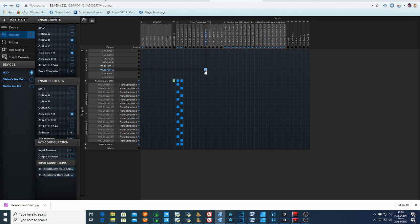Otherwise I'll sing along and you don't want that. Further down, you can see Clive and Christine are exiting the 112D stage left over AVB to the PreSonus 16R, just like well-behaved digits. We've got some information down here about our AVB configuration. But what about the splits to the MacBook Air? I routed some AVB streams back to the Motu so we can do an off-air check. Let's have a listen to the return from the 16R.